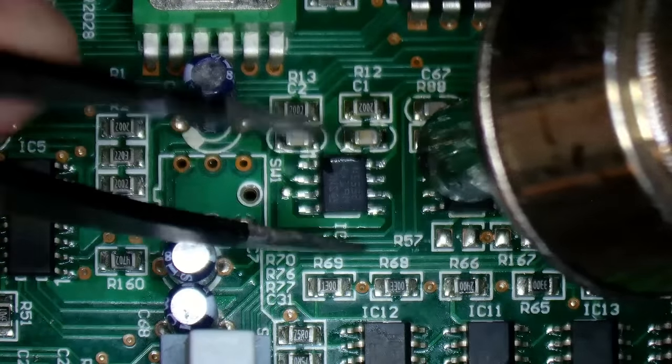I just had another look at the lid of this mixing desk and I've noticed that these stereo outputs are actually inputs. That's why there's no signal. There's even a gain knob for each one. That's definitely input terminology. It even shows it on the block diagram, look.